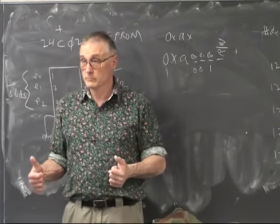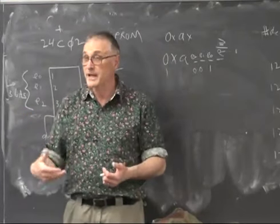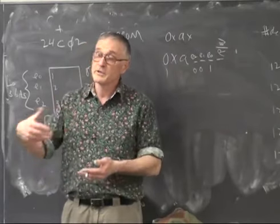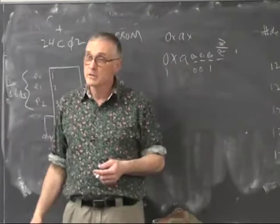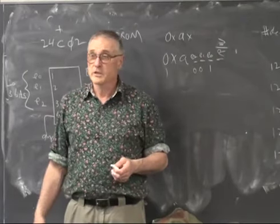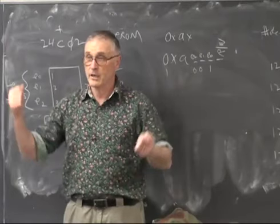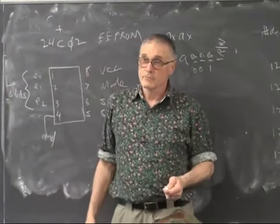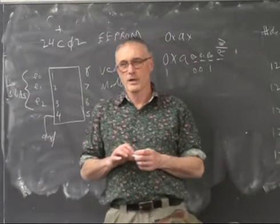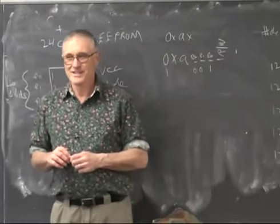Yeah. So you could put it to sleep with the TRT interface, or you could multitask off of it. You could just let this run in one thread while some other thread executes. Yes. So you'd have the interrupt signal a semaphore in TRT to say, "I'm ready." By the way, a context switch in tiny real time takes 400 cycles. It's a snoozer.